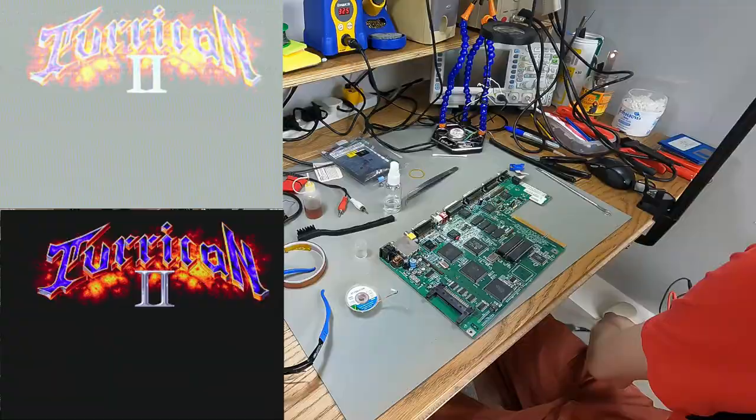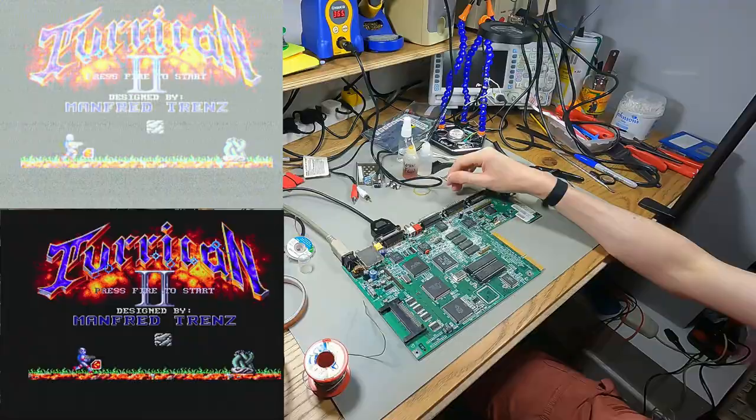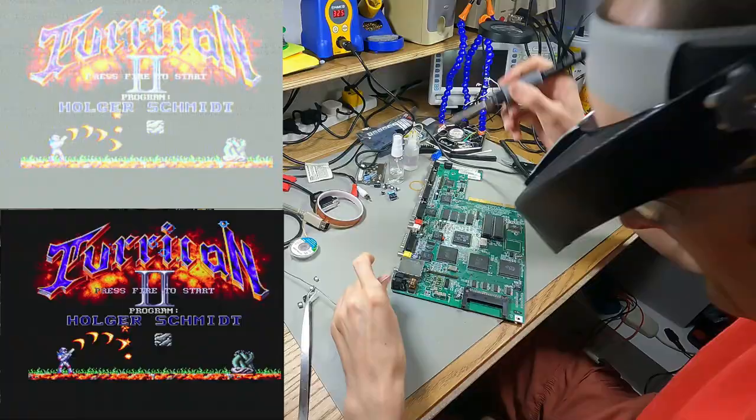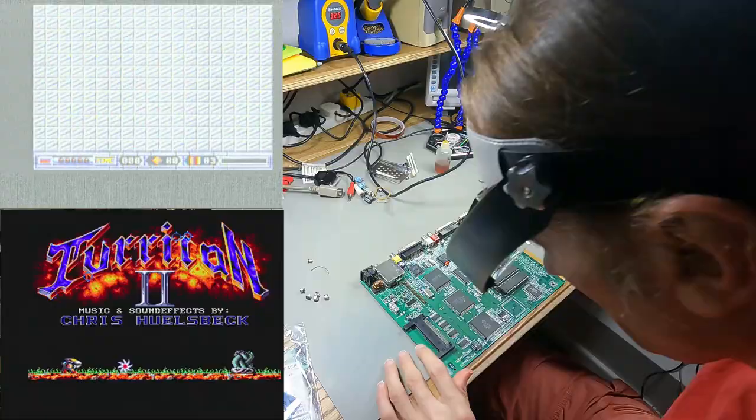While doing the recap, I thought it'd be worth looking at the composite video first. I checked the RGB video to make sure it's okay — RGB is on the bottom left and the composite is top left. The RGB looks fine, so the digital RGB going into the DAC is coming out as analog RGB into the video encoder. But what's coming out of the composite looks a bit messed up — so it's either the composite video encoder chip or the caps, and it's likely the caps.